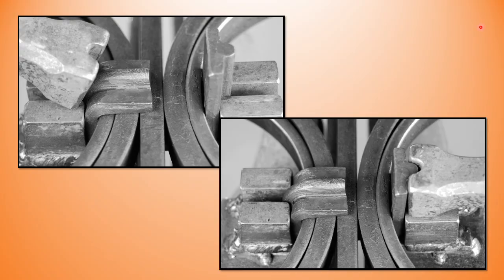Using either your mandrel or the Grille, and I prefer the mandrel, we're going to bend these final two pieces over. Let's have a look at this piece here first. Can you see this corner? You can see I've relieved it just slightly with a file. That's going to mean that as I bend this over, that corner is not going to stick out and hit this bead or the collaring material. It should slip by. So that's important for me. Don't overcook that, just make a little mark, but it's handy to have around.